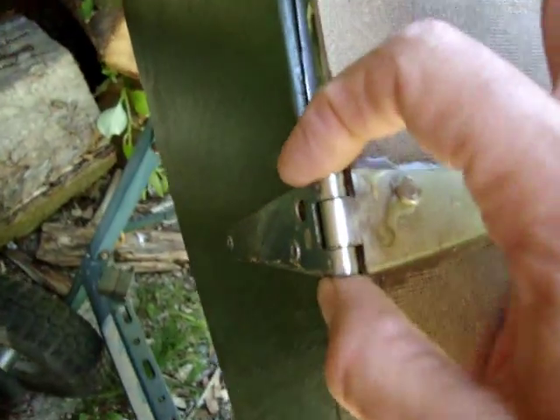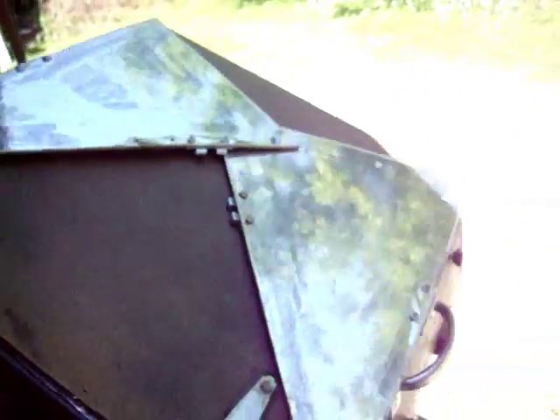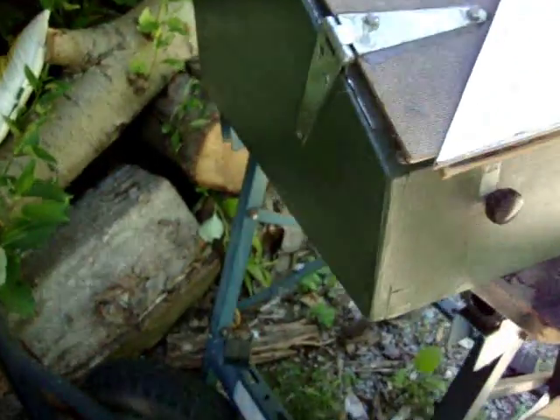Now the other side — same thing, more hinges here and up here where the other little clamp is. The reason the gate hinges are so big is because I needed to have them extended up. If you look, there's quite a gap here, and the reason for that is it leaves you the space for that one to fold down first. When these are folded down on top of it, then this one will fold down flat. And there you are — you're ready to carry it. The only two pieces you're left with are the front and rear reflectors, and this is where the angle brackets come in.